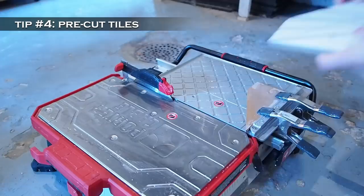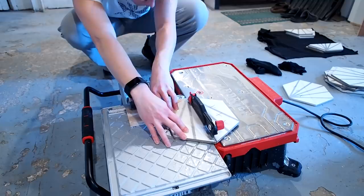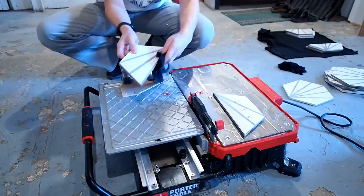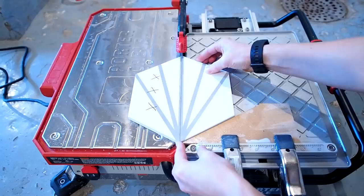This is a fairly affordable sliding wet saw that I purchased on Amazon, and I'll leave the link down below. I started cutting a few tiles in half for the front row, taking it nice and slow and letting the blade do the work. I'm using a wedge to help support the tile, and this brings me to tip number five: when cutting hexagon tiles, cut yourself two wedges. When cutting in this direction, there's really no reference edge to put up against the back fence, so having a wedge helps support the piece as you push it through.